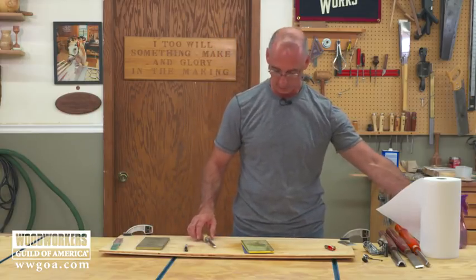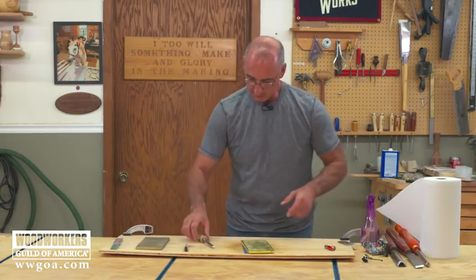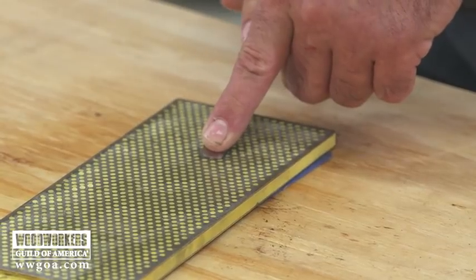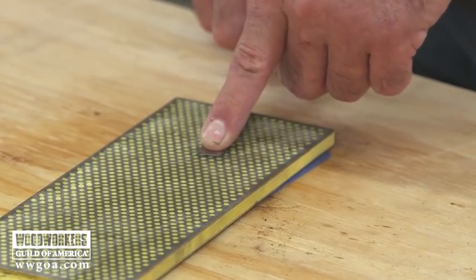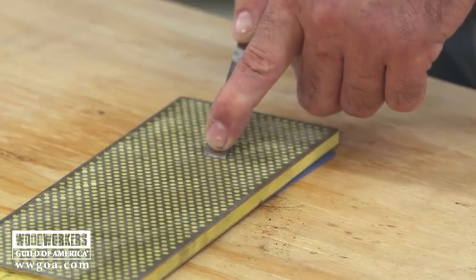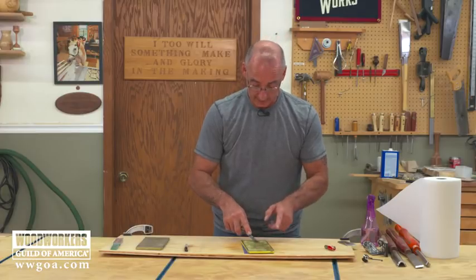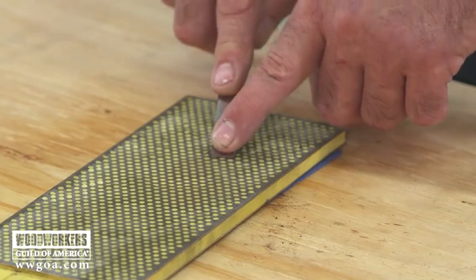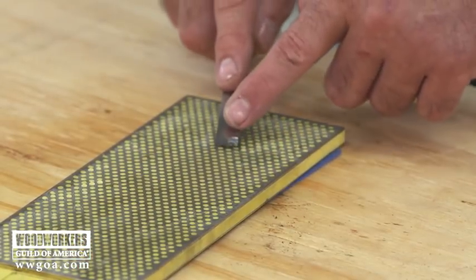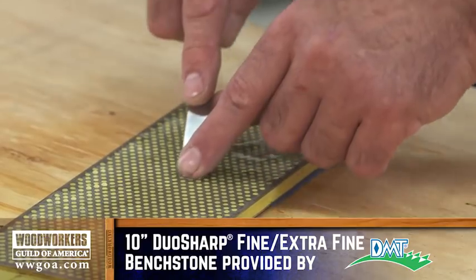Let's do this chisel a couple different ways. On this first approach, watch really close — make sure you've got a puddle of liquid on there. Look right where the tip of the chisel is about to meet the stone as I roll it up. Watch the puddle form right in front of that tip — it pushes the liquid out because right there the bevel is flat on the stone. What I do is keep this finger here, see the puddle, feel it go flat, make a stroke. When you're first getting started, see the puddle, feel it go flat, make a stroke. Once you get going, you can go in both directions.